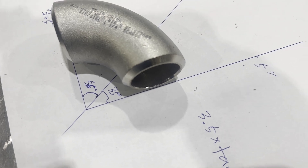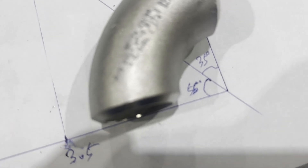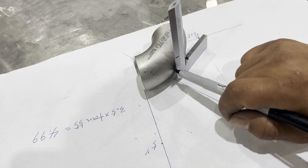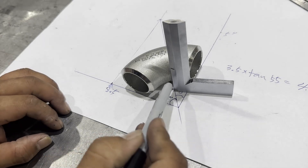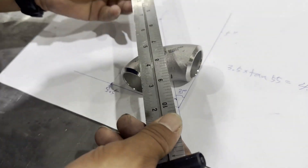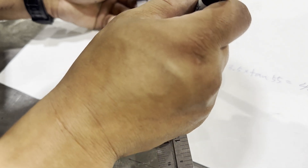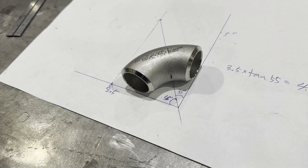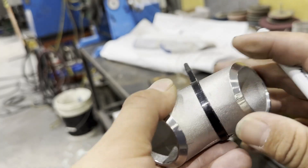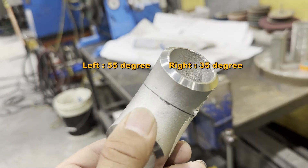Next, place the elbow on the laid-out line. Both ends of the elbow should be aligned with the x and y-axis and straight. Lay a square along the diagonal line and mark the elbow outside, then mark the inside. To mark the top and bottom of the elbow, place a steel ruler on top of the elbow, align each edge to the diagonal line using eyeballing, and mark on the elbow. Connect these marks using a zip tie — a rubber band or O-ring can be a substitute.